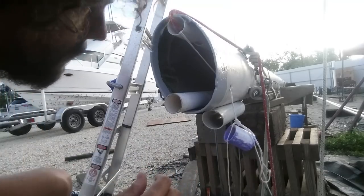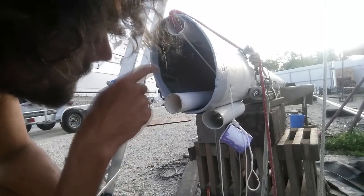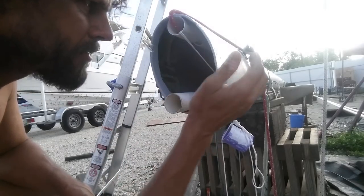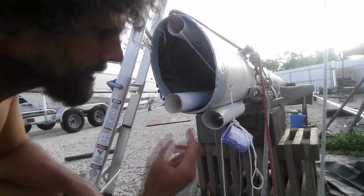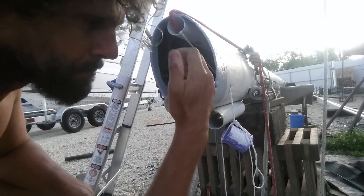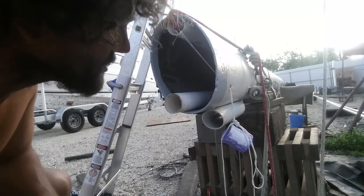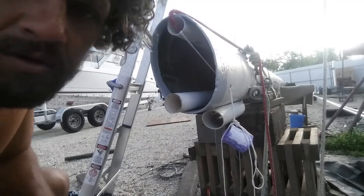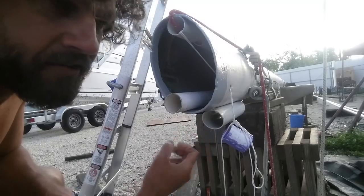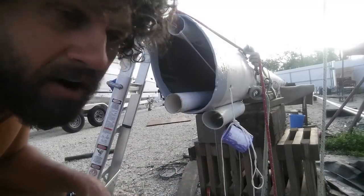But I found that if I tilted the mast in such a way and I looked through, I could see no rivets or no through mast fittings, and the pipe was sitting directly on the mast. So whenever we drilled it, the pipe was actually fully against the mast. So we didn't really need to pull it down with that much pressure. But I can understand that in most situations this pipe is going to go over and under in all sorts of contorted ways. So you really do need a hole on either side and to pull it down, because if you don't get the rivet meshed against the mast, it'll just break off.